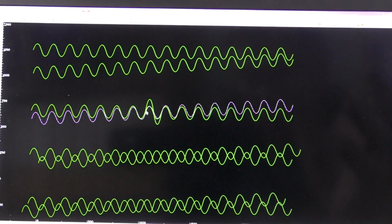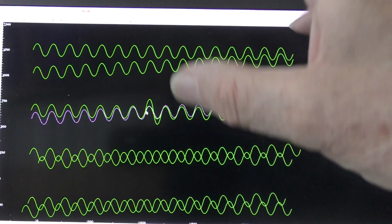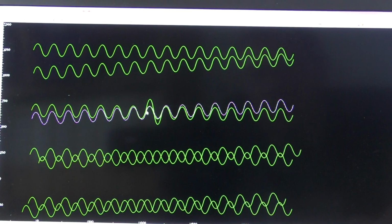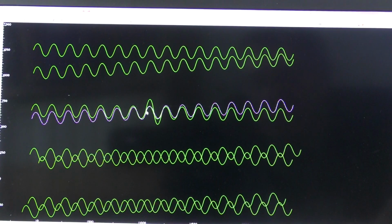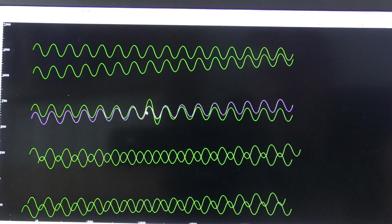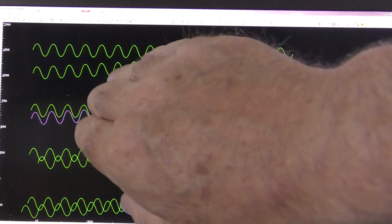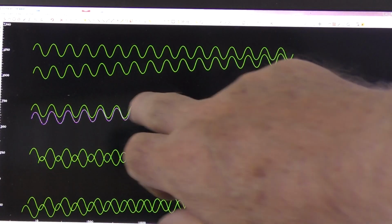We're going to go back to the machine. If we can find the point at which we get the maximum density of our bubbles in the center of the material, we should be able to detune by reducing the power to make the bubbles less. So we leave the focus as it is, and we should be able to tune the bubbles out. We should be able to lift the focus up and lift the focus down and bring this point closer and further away from the top or the bottom of the material.